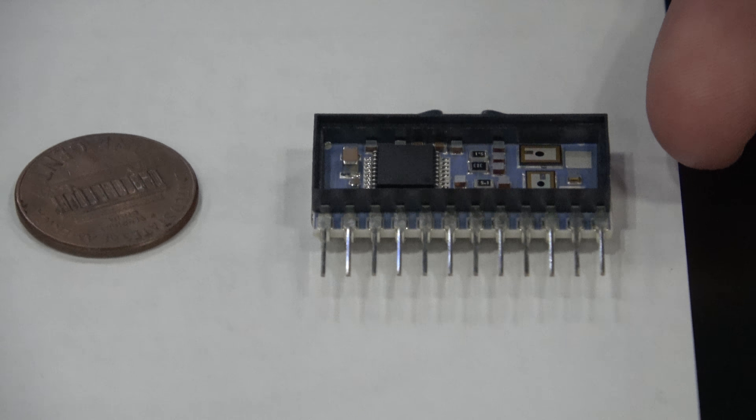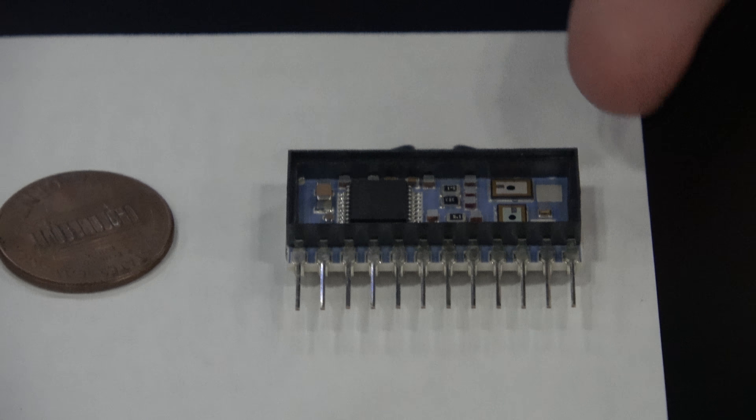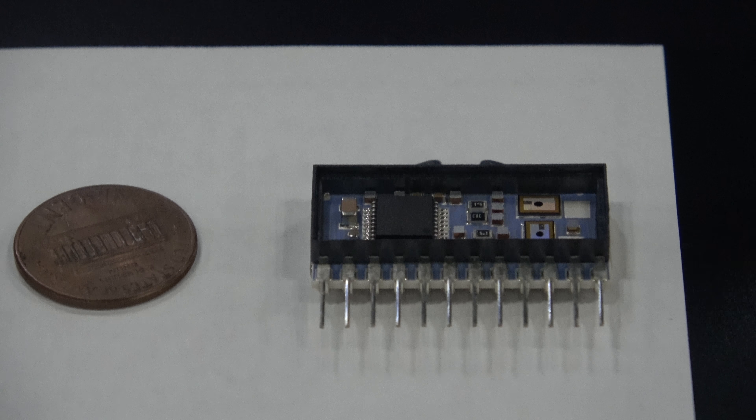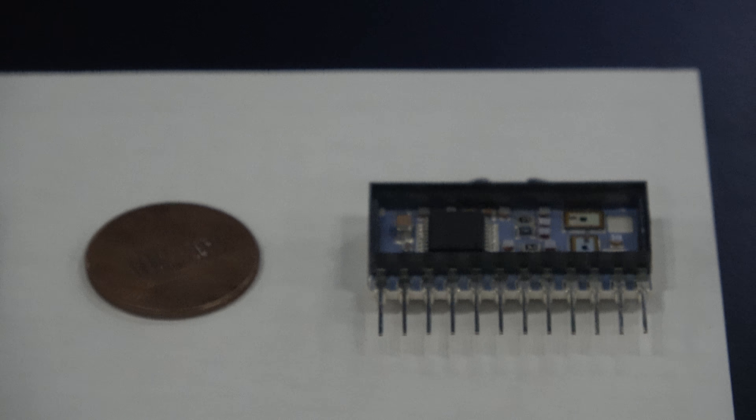We also can put in the silicon carbide Schottky diodes if necessary, and then you have on the same substrate the gate driver. With that technology we can reduce the parasitics, enabling the end user to switch at significantly higher frequencies than with a discrete redesign. We tested the amplifier at 500 kHz with very clean switching signals and very little ringing.